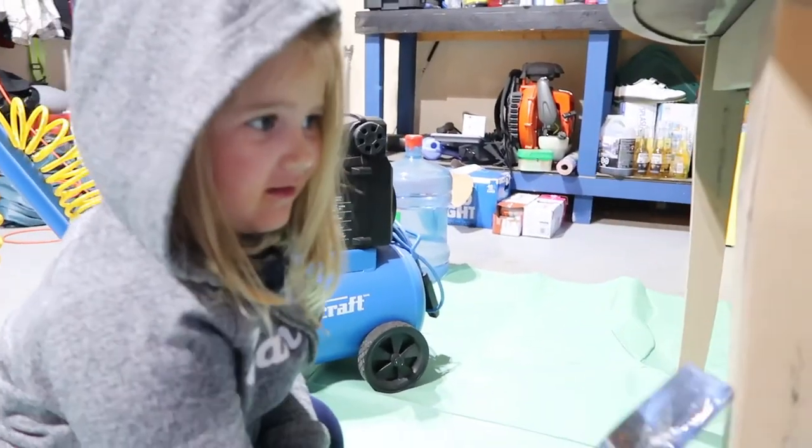I'm doing alright, kiddo. So I think that is it for this table. One thing that we learned, because we weren't sure, you don't need a lot. If you put on too much of this polyurethane, it actually turns into almost like a gel. I don't think we used the right brushes, and we put on too much, but it's drying really quickly. Also, our table's old, so our table might just be thirsty and soaking it in. But next up, let this dry, and then I'll show you guys tomorrow.